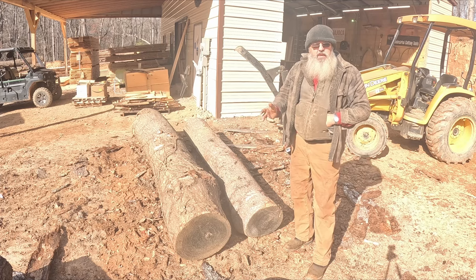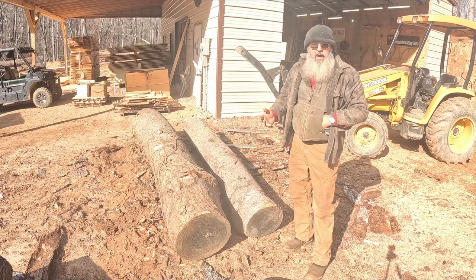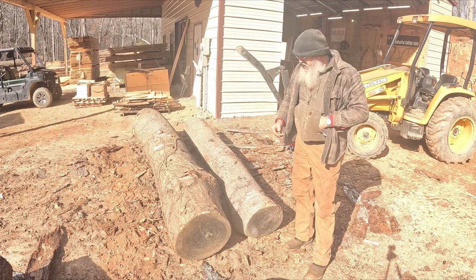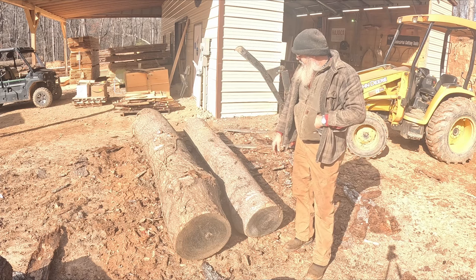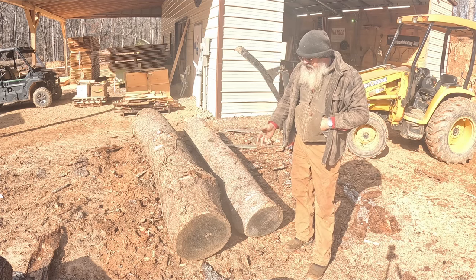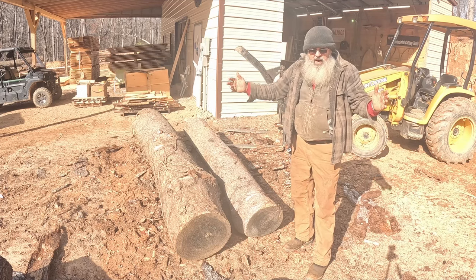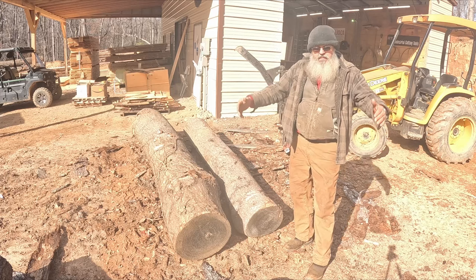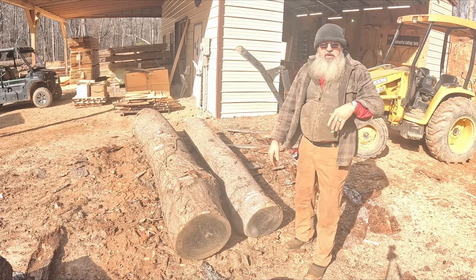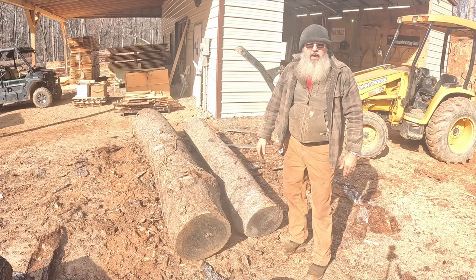The wood itself is very soft. I would rate it softer than white pine as far as sawing. It's very lightweight, similar weight to white pine. A lot of people years ago used them because the trees were so big and they could cut big wide boards and they wouldn't warp and cup. My dad's got some on a barn up here that are 30+ inches wide and 100 years old, and they're still flat as the day they cut them.